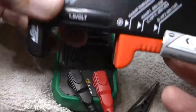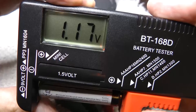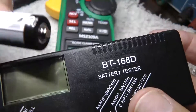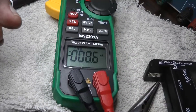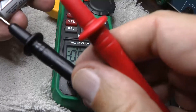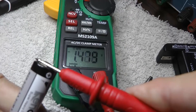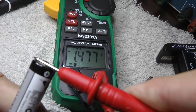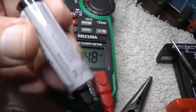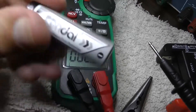Let's test this battery under a load. Now we've got this all sealed up, screws are back in. Under a load, the battery is showing 1.16 volts. You should not leave it under a load for more than two or three seconds — that'll give you a very accurate number. By comparison, the multimeter is showing 1.47 to 1.48 volts, which is inaccurate and is not going to give you any idea that the battery is not healthy.